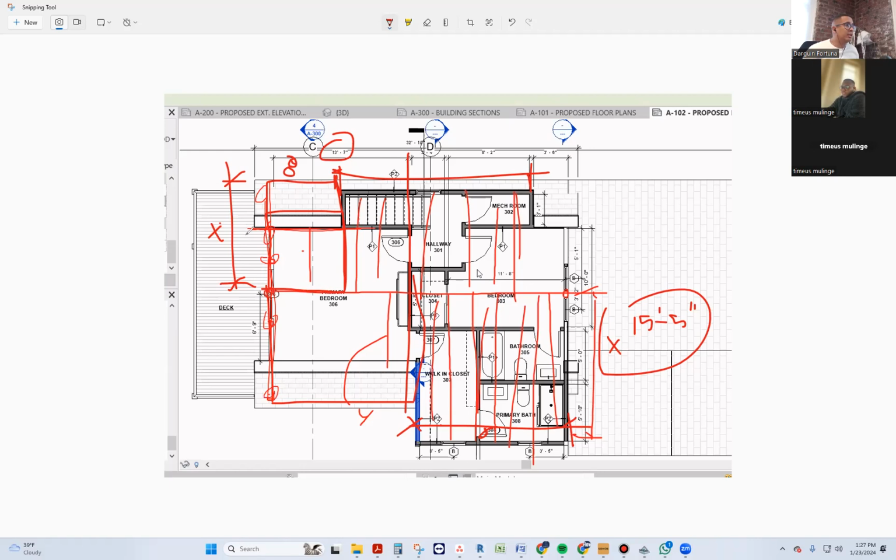So make sure to size a wall so you know what I'm saying. You're gonna have beam, column, column, header. Exactly the same sketch you just showed me. You're also gonna size this. Even though it's a wall, you have to size your columns for this beam. You know how to put the different points. You have your beam and it's gonna have one point load and another point load. Okay, got it.